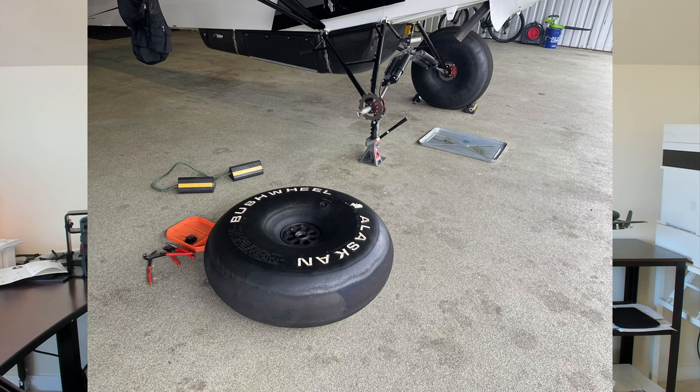Now I'll take that back. Getting the safety cable, which, oh, by the way, when I took that safety cable off, it looked thicker than normal to me. You know, typically we're using 0.032 safety cable for what we do with the aircraft maintenance. And sure enough, I came home, read the manual after I did the work, which was brilliant, and saw that they specified 0.04, which I happen to have. So it was hard enough getting that safety wire threading into the grooves. Takes some practice for us first-timers, but after several attempts, got it done right.